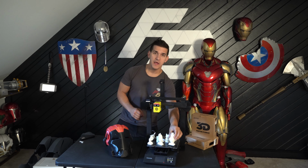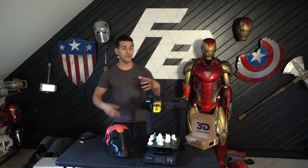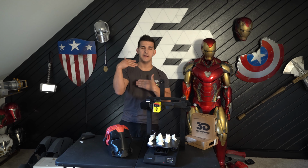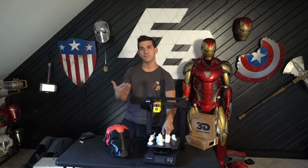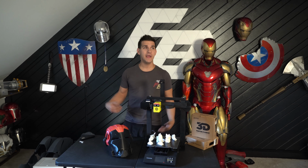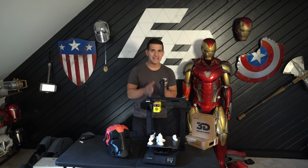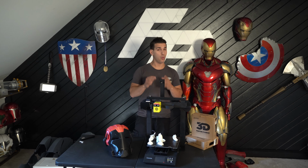I would come into the room, take off one print, find the G-code. The printer's already cooled down. I didn't even clean the bed off. I would find the next G-code in the line of the pre-assembled models or the pre-loaded G-code, hit print, walk away, come back in a few hours, remove the next model, rinse and repeat. I didn't have a single failed print on this printer once I leveled it.